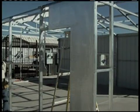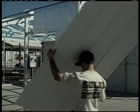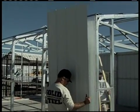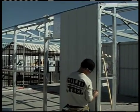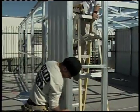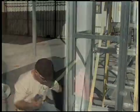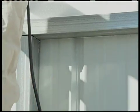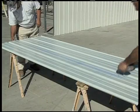As you get a row of insulation on, you can then apply a sheet of the exterior panel over it. This will prevent the wind or elements from damaging the insulation. This is very important — apply an exterior panel over each length of insulation as you go. If you don't, you're liable to have all the insulation come down with a bit of wind. Don't try installing insulation on a windy day.